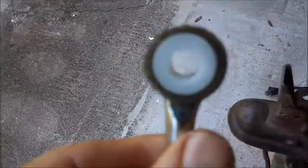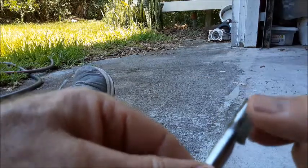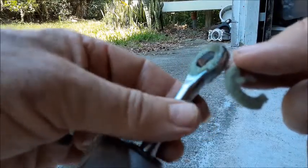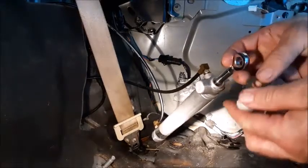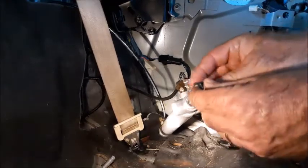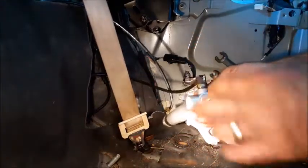As you study this plastic grommet in the end of the plunger, you'll notice that one side is totally smooth and the other side has a ring around the center — that's actually a snap ring. Find a surface to push right in the middle of the snap ring. I'm going to use the trailer hitch on our little trailer, lining it up on that spot and pushing down — pop, that piece snapped right off. There are also foam washers underneath — they're stuck to the old casing and you have to tear them off slowly without damaging them. Reinstall them on the new cylinder: foam washer on, stick it through, second foam washer, and squeeze it — it will snap together just like that.